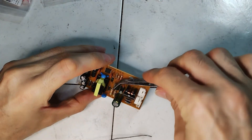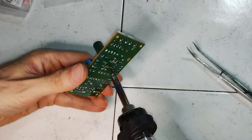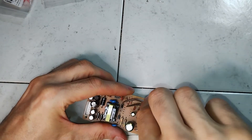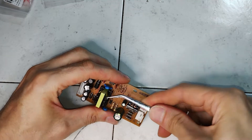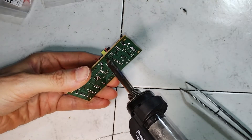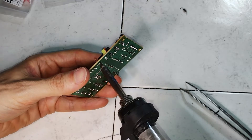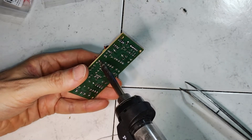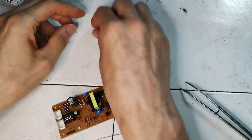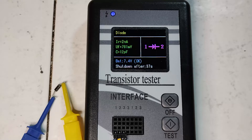This is the controller RM6203. This is the diode D6 type FR107. This is the optocoupler type EL817. The diode and the optocoupler seem to be still operational and they are installed back on the board.